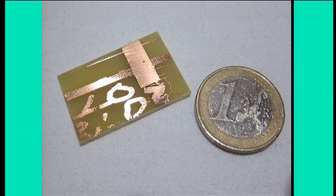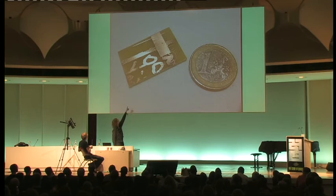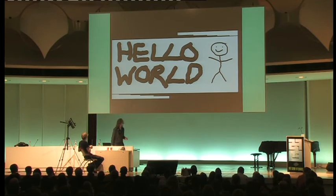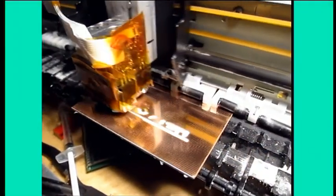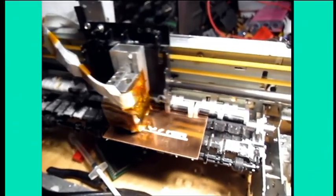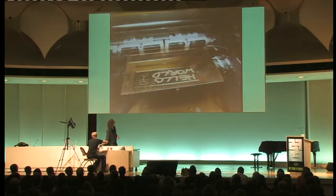I reduced the spacing between lines and printed thicker wax to get a solid patch, which I was really happy with because it proves you can make a thick etch-resistant layer — good enough to print ground planes on your PCB. There's a single pinhole defect in the middle, but other than that it's a perfectly solid plane. For raster images, you can just about see this raster image emerging from the machine one line at a time — I'm only using a single nozzle at the moment because of various problems, so it's really slow, but it certainly works.